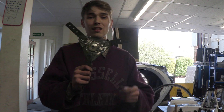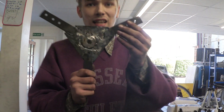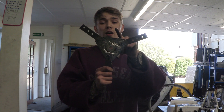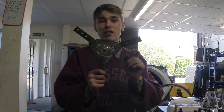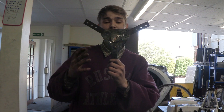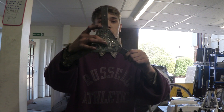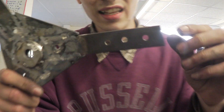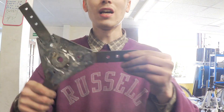There's been a slight change of plan on how I'm actually going to attach the blades onto the motor. Instead of the original adaptation plate that I made, I've decided to do this. It's the same bars I cut out before, but I've cut out three triangles at 120 degrees so I know everything is evenly spaced apart. Here's the middle section, the bolt holes for the case, and the holes for the actual blades.